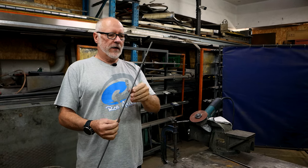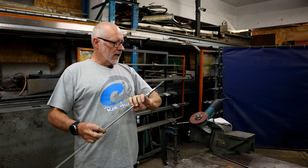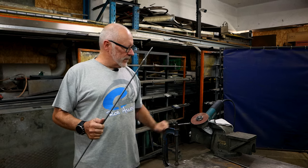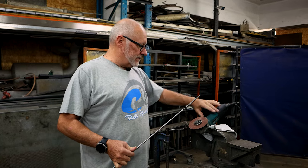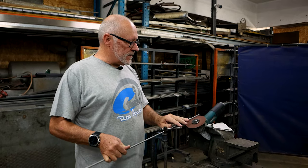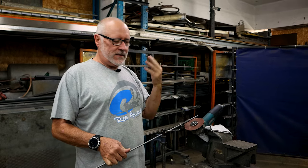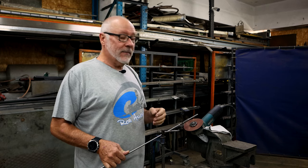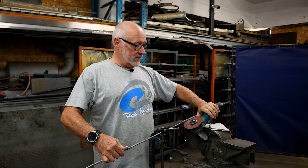In my case I've just put an o-ring around it. This is an existing tri-cut — I'm just going to go through the process of rotating it. I like to have the disc rotating in its direction; in this case it's anti-clockwise. I want to sharpen so the sparks are blowing away from me. I do have glasses on — although they're reading glasses they're adequate — but preferably use proper safety glasses. Let's see how it goes.